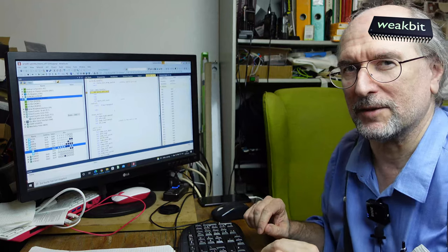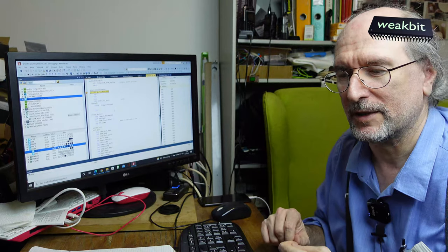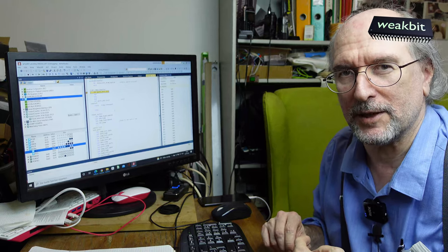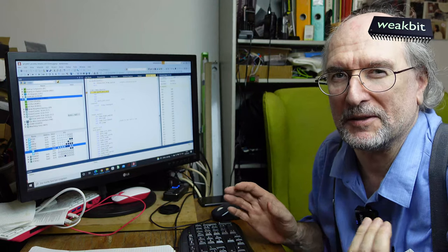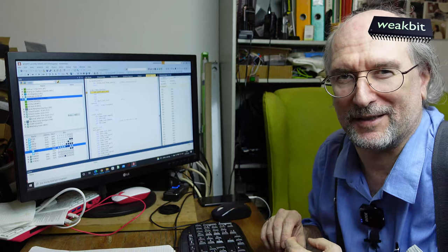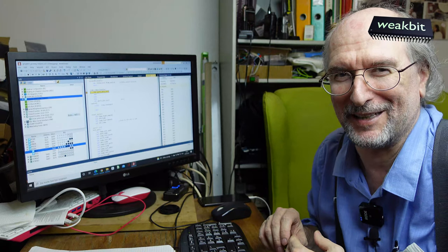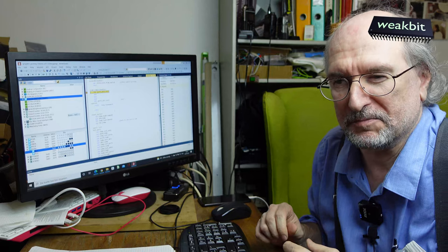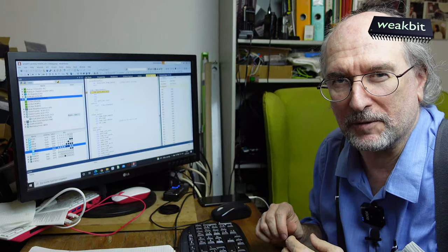I'm initializing a timer that repeats every 10 milliseconds. And then after this, it waits for an interrupt from an external pin. I will send the pin from this processor that's making this mistake out. I think it's a dead counter, but in 1995 nobody knows what a dead counter is. They're making the machine defect, and I think I can fix this issue with this small program and with a microcontroller.